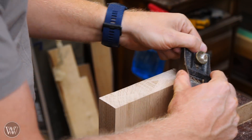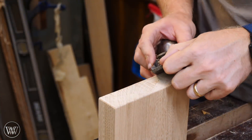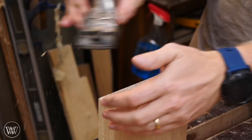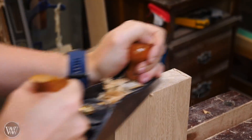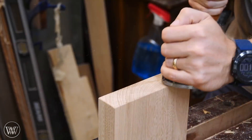Once that's done, I'm going to shoot the other end. Rather than using the shooting board, I'm just going to use a block plane — you could also do this with a low angle jack. I'm just going to miter the ends a little bit and clean up any of the rough marks. I find it a little bit easier to grab the low angle jack plane for the final detail, just taking a shaving off the end, bringing it down right to the line. And there, you have a square end — it's not that hard.